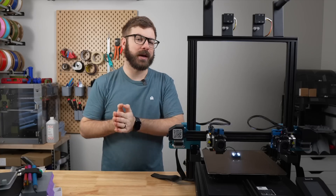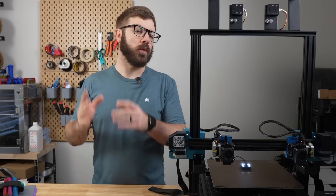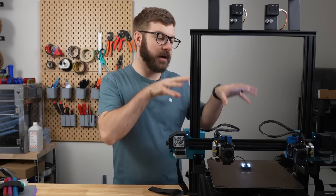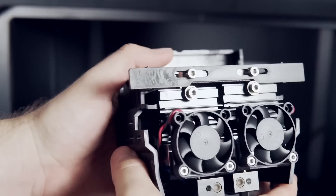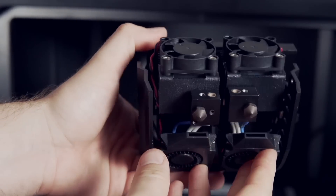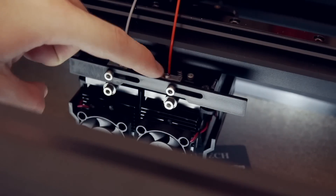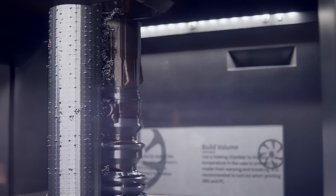For those not familiar with multi-toolhead 3D printing, let's quickly touch on the why. With dual-extrusion 3D printers or tool changers, you'll have to calibrate the X, Y, and Z offsets of every toolhead. Due to manufacturing tolerances, those offsets are always going to be slightly different whether you assemble your own printer or buy it from a factory. To have reliable prints, the nozzle from each toolhead needs to be as perfectly aligned as possible, and calibrating those offsets is a must.